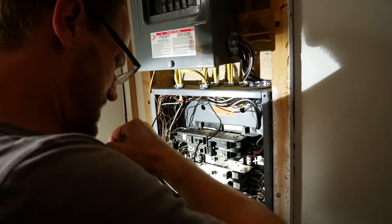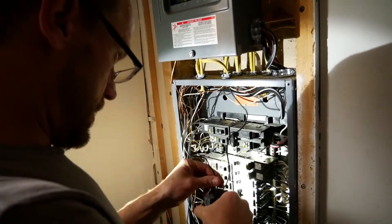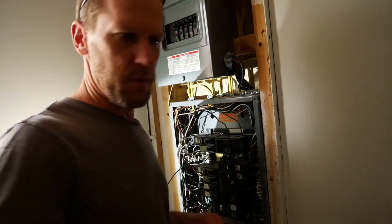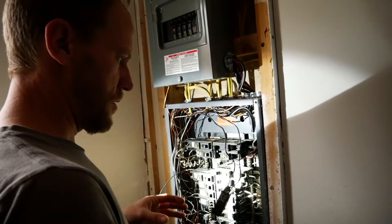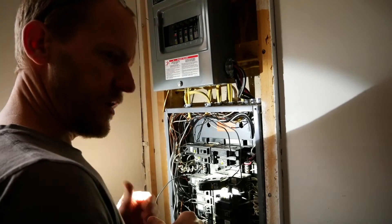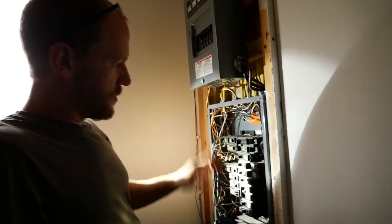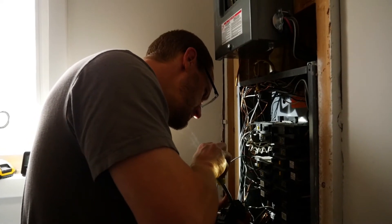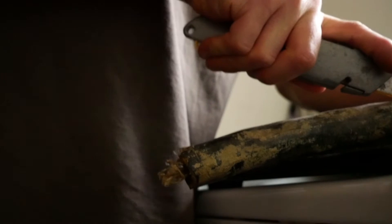What we're having to do is combine some stuff to make room for another 30-amp breaker, because the old feed to the other building was fed from outside. I want to feed it from this panel in the main house because we can put this panel on our backup generator — we could never feed the other building before because it fed from the meter panel and I couldn't tie the generator into that. We were able to combine some stuff because they had tiny little things on a breaker by itself. With every big main project there's a little project that has to be done before it, and then a littler project before that — so often it feels like you take two steps back to take one step forward. This is so unprofessional.